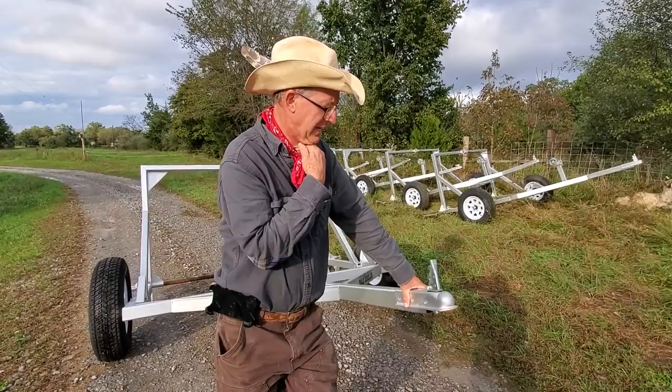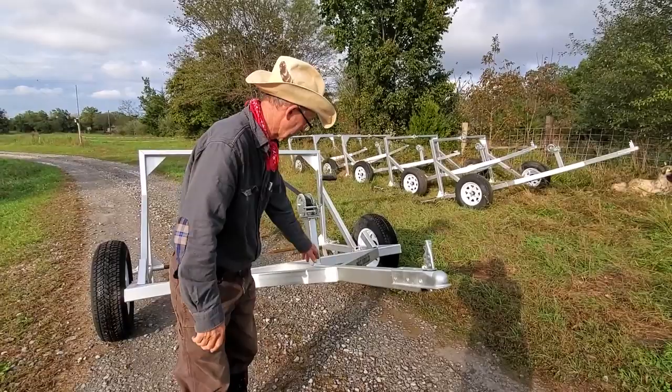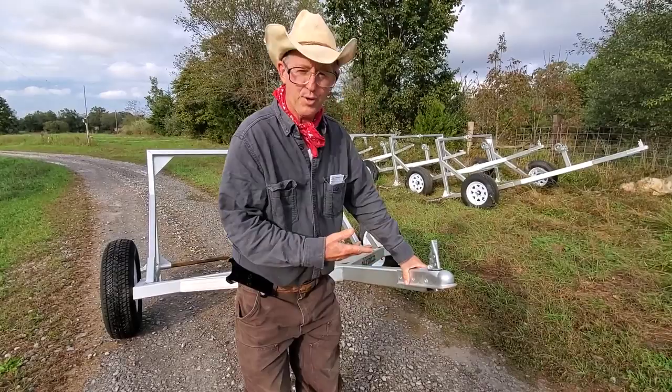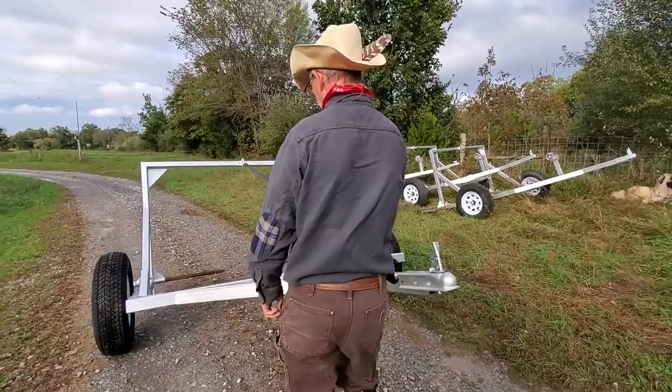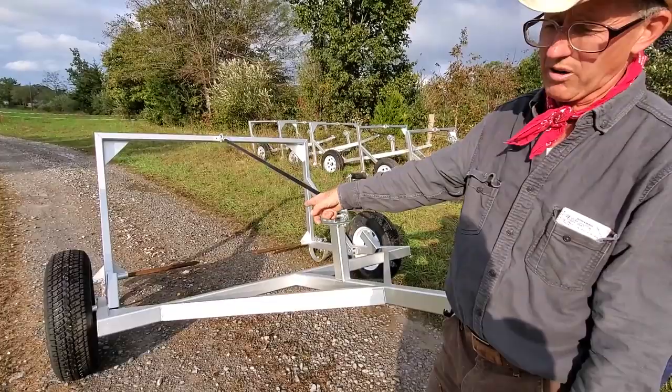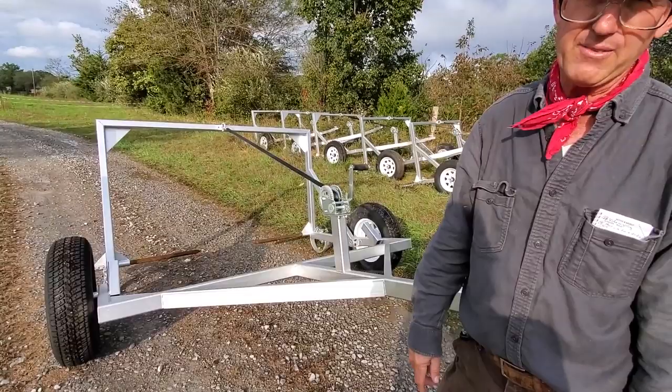I've just made it better. We've got it thicker, it's more heavy duty. It's all got super brand new heavy duty angle iron on it. We've tried to tear this thing up going over stumps, rocks, down through the woods, some of our silvopasture areas. So far we haven't been able to tear it up. We've got the right spindles on here now. We started out with the spikes — they're a little bit smaller diameter than what we used to use. Those are super hardened spikes, an inch and a half diameter. The axles on here are 3,500 pounds.